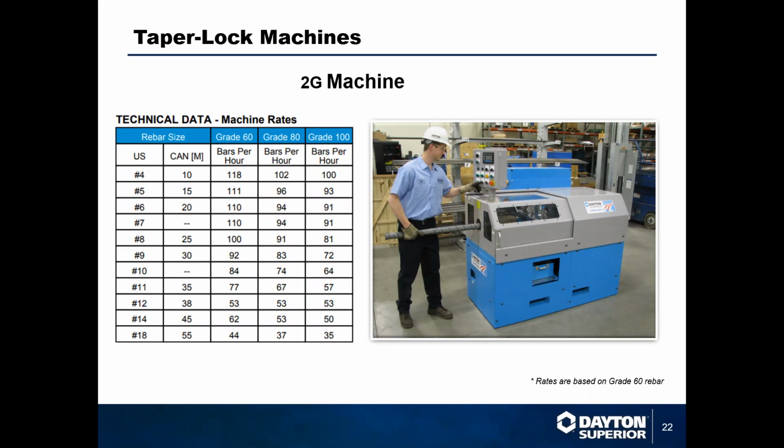This is the machine that we were talking about that threads the bar. We place these around the country in various fabricators, and all of this is enclosed. All the action in the machine happens right inside that compartment where you can see the windows. It's very simple. You just insert the piece of rebar, punch a couple of buttons, the clamps inside clamp down on the bar, and the thread puts the desired pitch on there for whatever bar size you have.